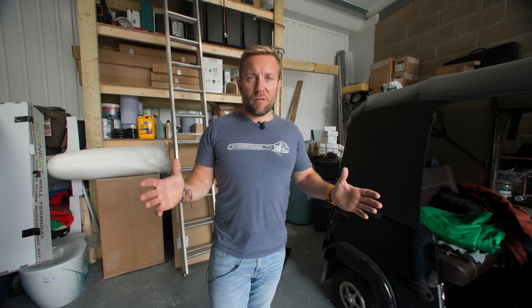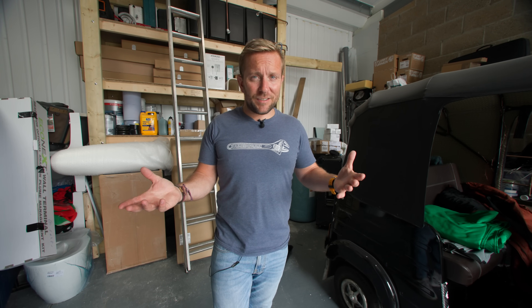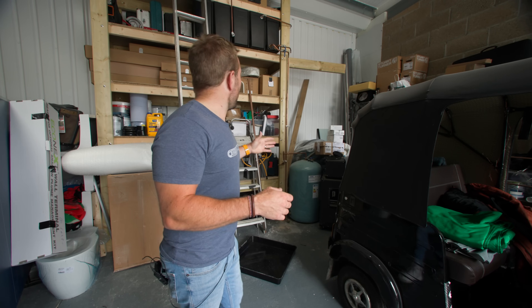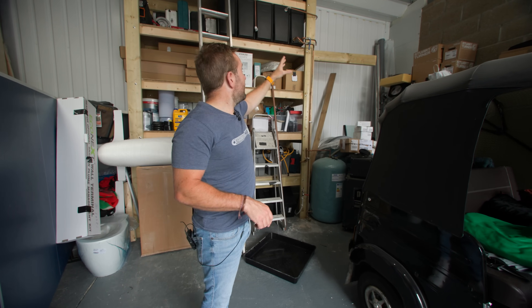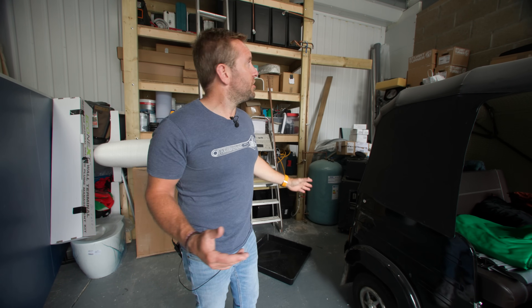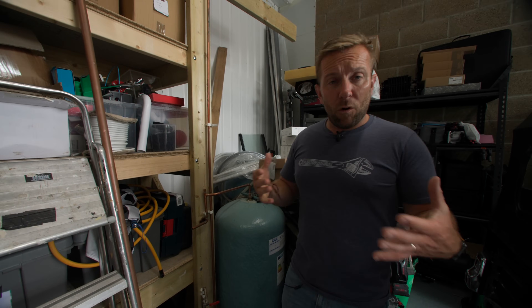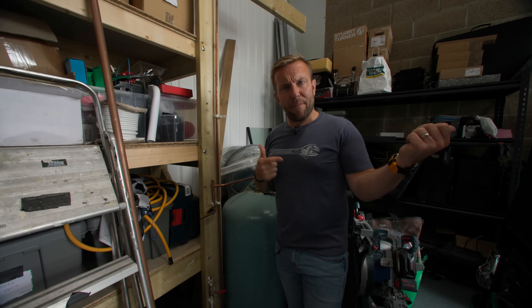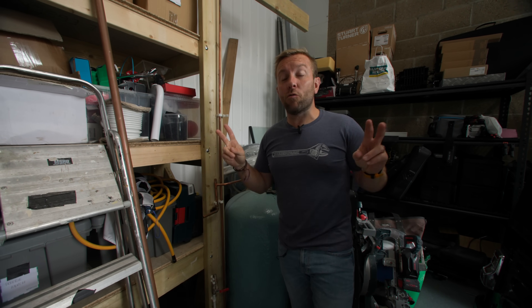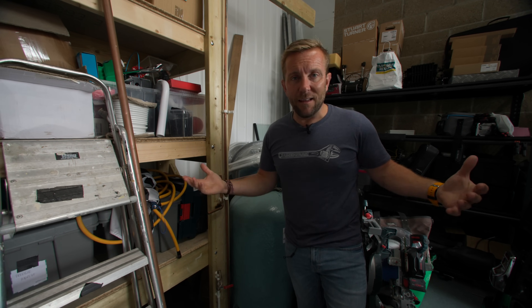You've seen what's in the box. Does the fan do something? We've seen there's no extra power — we're not putting any extra energy into this. From a physics perspective, it really shouldn't work. Maybe it's just got smaller holes on the outlet. We're going to pipe up the feed to the ball valve on that tank up there, join it with a bit of flexi pipe, cut this pipe here, pop a small connector on it, put a shower hose off that. That will simulate exactly the shower head pressure you'd normally get in a house. If you've got a pressurized system already, this shower head is not going to do anything — it's not going to make it better.